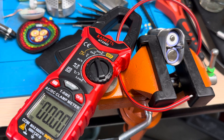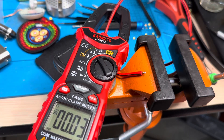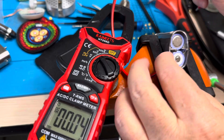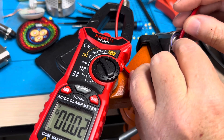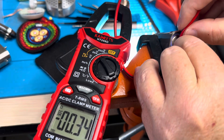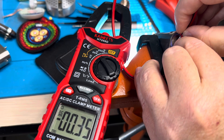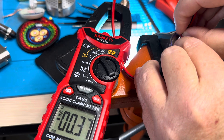As a bonus, I'm going to do one more flashlight. The reason I even thought to make this video was because I wanted to measure this flashlight — I didn't know what its amperage was at the highest amount. I'm going to pop it into my vice to hold onto it tightly and do the same thing. This will be a surprise because I have not done this yet. Let's complete the circuit and see what I'm reading. I'm reading about 0.35. Since I'm in series, I have to double it — that gets about 0.7 amps. There's probably a little loss, so this is probably somewhere between 750 milliamps and one amp at the highest.